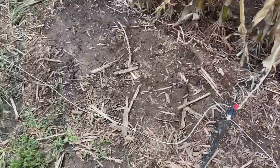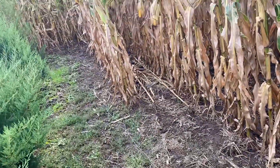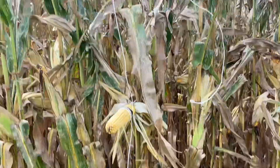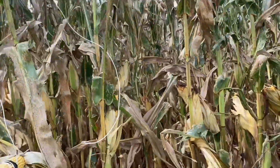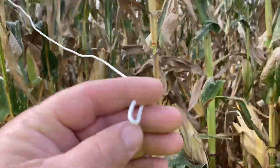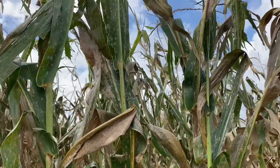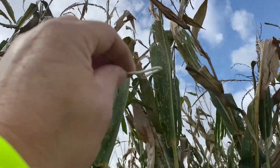We put two 16-foot radials, one each way, and they track the same direction as the top hat - north-south. The top hat's pointing north-south. I see my wire came off up there; I just hooked it on a distant corn stalk to help hold it tight.